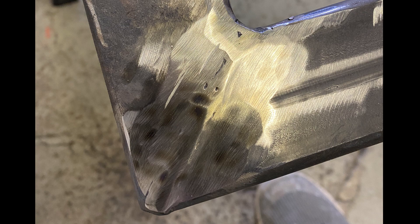You can see in this image that I wasn't getting total penetration and I had some holes — I wasn't totally comfortable with the welds. There were some holes in them, so I ground the back down with a 24-grit grinder and then I used an old floppy grinder blade and took them down a little more, and then I ran new welds on them.